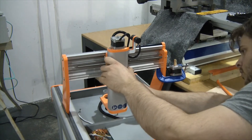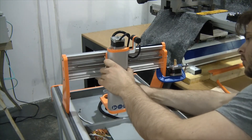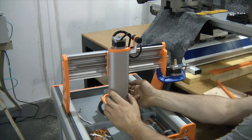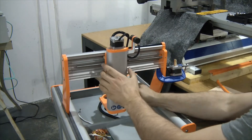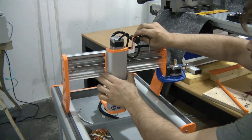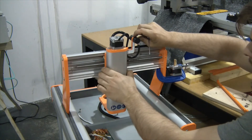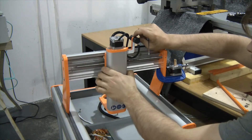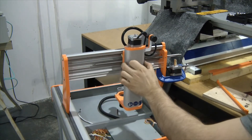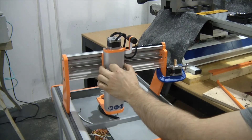This is the stage where you tune your brass rollers fine. The allen key is in there and I'm checking it's tight. It needs to be to such an extent that there is no mechanical, physical play or rock in the rollers on the aluminium, but I can still test and feel the rollers move nice and free.